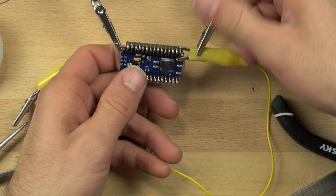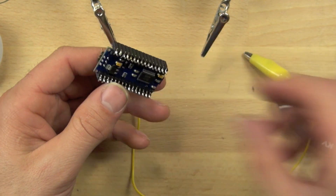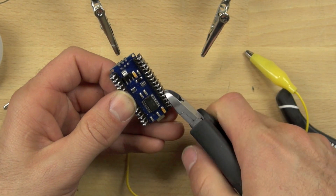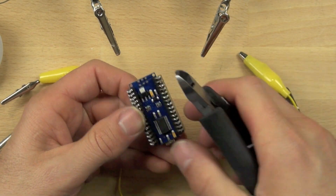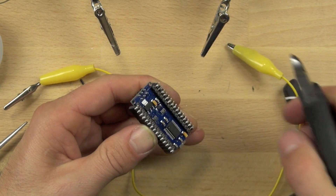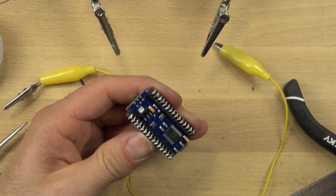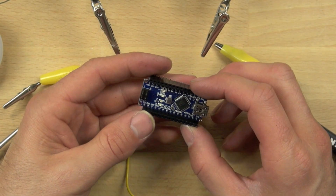This is the second side — I did the second side the exact same way as the first side — so now we can easily swap things out. I'm trimming off the excess wires that stick past the solder joint using the nipper pliers. When you do this, make sure you're wearing safety glasses because those extra little wires can fly off.